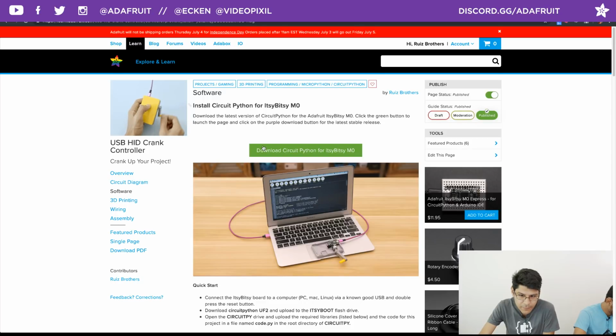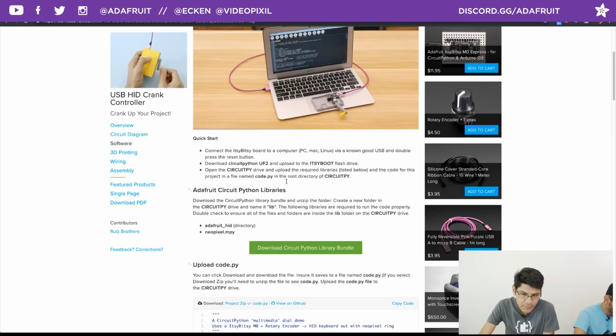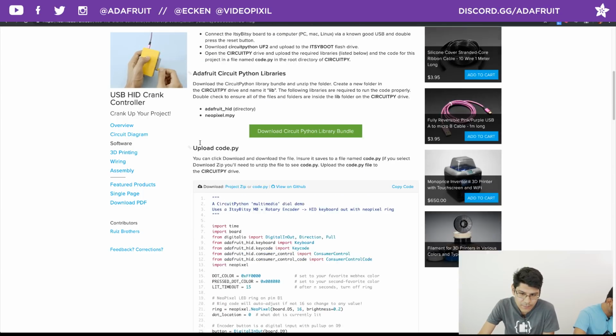Here's the software part. It walks you through installing CircuitPython. It's as easy as going to circuitpython.org, selecting the board, and downloading. But I already have that link here for you, so you don't have to do that. You can just click on that and download the latest version of CircuitPython. It just needs two libraries. It needs the NeoPixel library and the Adafruit HID library. So you just get those two. And here is the code.